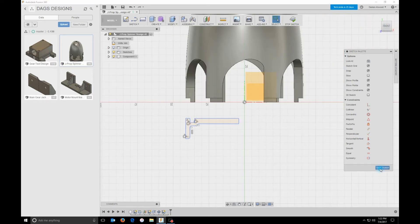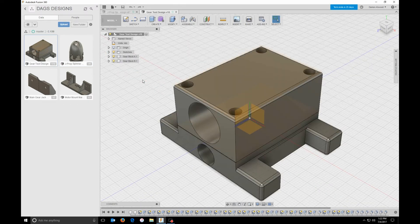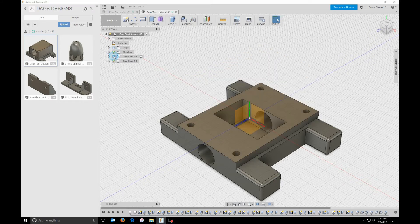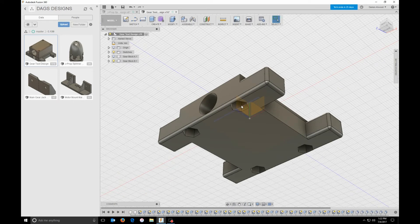This just gives you an idea of how beautiful this software is. Same thing if I go into my landing gear design for my block. If I go in here and turn off that block, you can see where I've made the holes. The really neat thing is I can actually specify the diameter of that hole and then mirror the hole — if I change one diameter by half a millimeter, it automatically updates all the other holes. Also on the bottom, I was able to put my hexagons in so that my nut is recessed into the drawing.